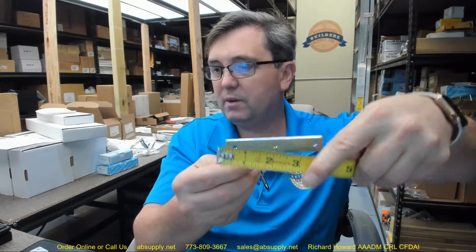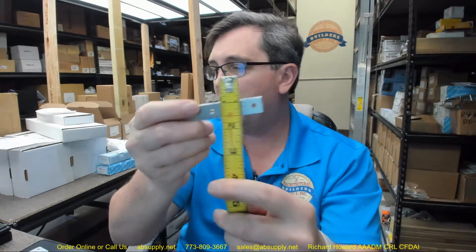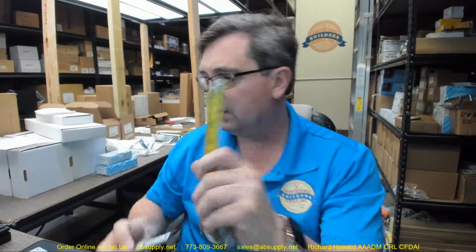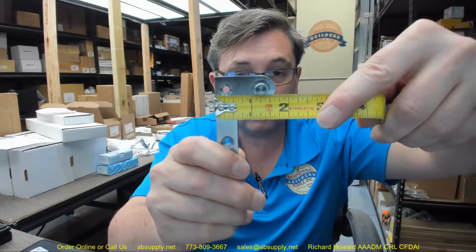You do not do a commercial situation where you tip it down and lean it in — that is how these are done. There is a link below this video to the template. Let us take a tour of its dimensional properties. This is marginally smaller than the PH40, maybe half an inch. The overall length of the pivot is 3 and 7/8ths inches. You have 5/8ths thick or wide of the arm material, quarter-inch thickness. They give you location for the screw holes. It is important to note that you have that inch and 5/8ths dimension from the back side of the pivot all the way out to the very leading tip. The vertical axis of pivoting is 1 and 1/4 inches.